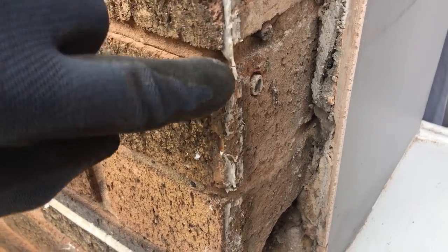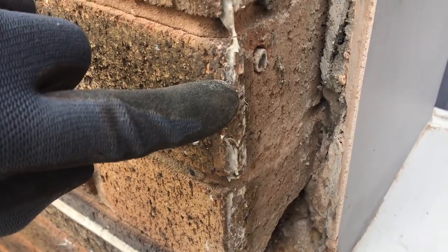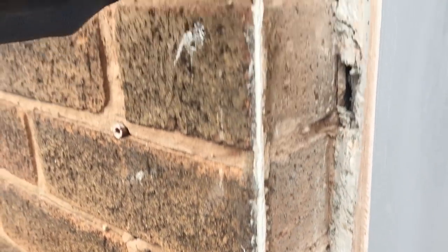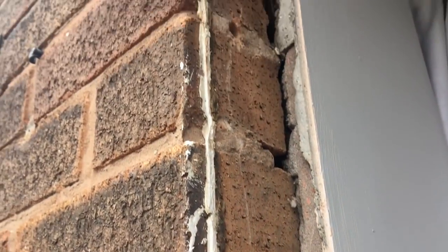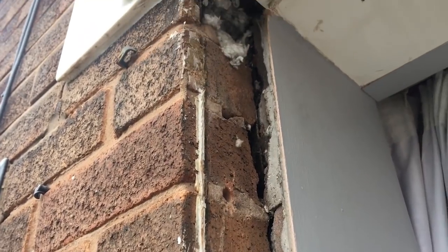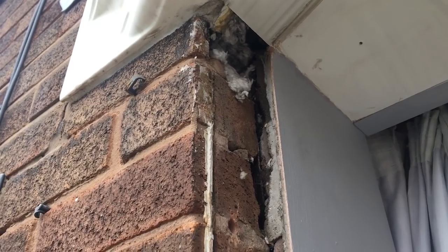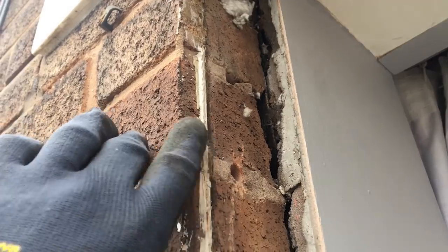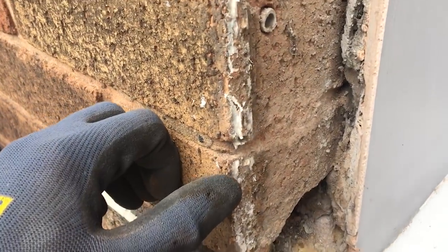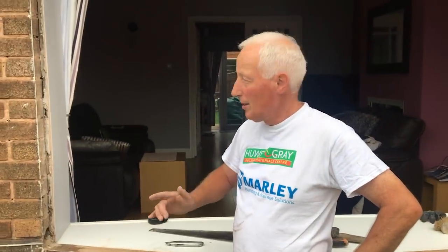You can see where the seal line is — it's right on the edge of the brick, which is a bit of a no-no. A lot of a no-no. As we go up here it goes more and more, so the old frame was out by at least 20mm from top to bottom. You can see the gap on the line here — it's 20mm at the top, nothing, zero at the bottom.